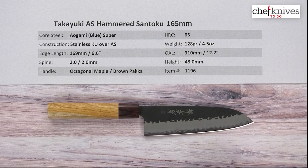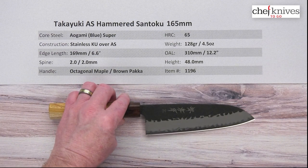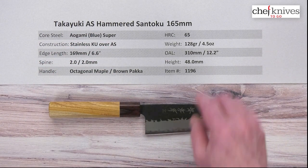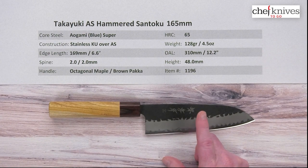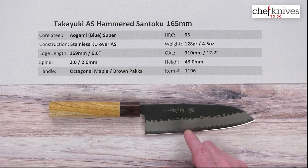This line of knives has 3-layer construction. We've got the hard center core cutting edge steel — you can easily see that cladding line right here. This has Aogami Blue Paper Super reactive high carbon steel, heat treated to about 64-65 Rockwell, so they take that pretty hard. This is going to be harder steel with more edge retention, and it's going to be a little bit more work to sharpen and a little more susceptible to chipping if you're not careful, versus a softer steel.